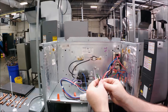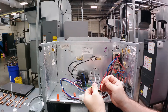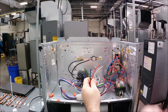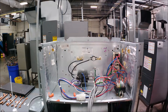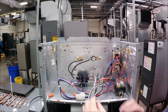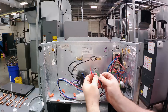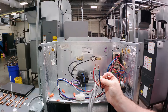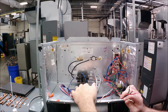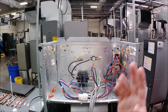Inside this air handler you're going to get four wires — not a terminal block on a circuit board, but four wires you'll have to wire into the system. I've got some orange wire nuts off to the side but nothing's wired yet. It's a heat-only system. They give you four wires: your 24V hot and 24V common — red and blue — a fan wire (G circuit), and your heat wire (W), which controls the contactor for the heating element. Same setup, just physically connected with wire nuts instead of a terminal block.